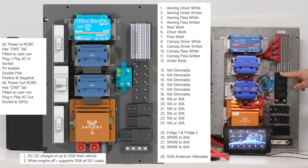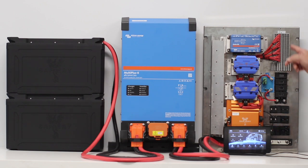The fuses we do use here: there's a fused Anderson plug for the fridge, and the bottom one is for charging from the alternator — that's a 120-amp DC-to-DC. You can run a cable into there, or if you wish you can hard-wire in. The board will operate at both 12 volts and 48 volts with the Scotty unit.